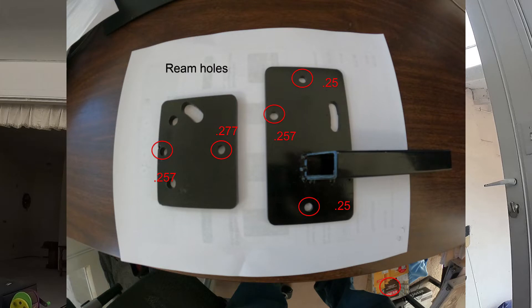Unfortunately, the Langmuir torch holders do not allow rotation around the Y axis, so we have to modify their torch holder to allow this type of rotation. This can be accomplished with the use of a new mount plate and spacer block. I have made the NC files required to cut these parts available in the description below. The small square tube on the mounting plate is optional — it makes calibration much easier, as you will see later. This new mounting approach makes use of all the existing Langmuir mount parts. After cutting the plate and spacer, make sure you drill and ream the specified holes to the tolerance as shown.